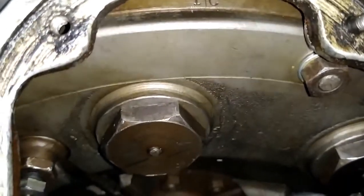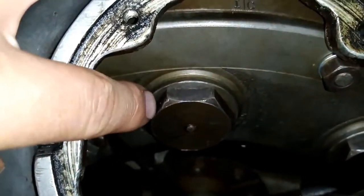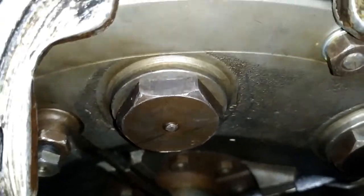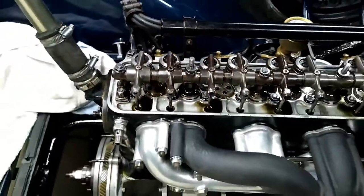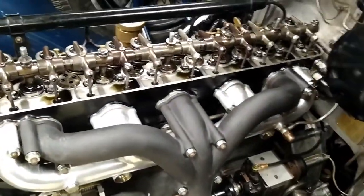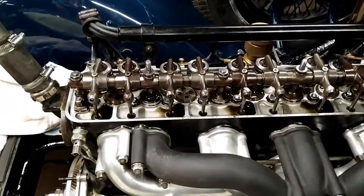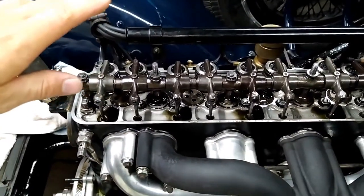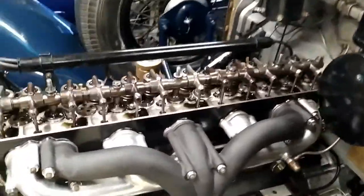If you don't have your flywheel in this position, you'd have to take a bar or some form of lever and spin it on these nuts — there are eight of them in there. What you need to do is go back to the engine, take the spark plug off the number one cylinder, then start turning the flywheel over with someone stood there and bring it to that IC position after one revolution. You then put a screwdriver down there and hold it — you do not turn the engine. What you should find is that the screwdriver sits quite a long way down.